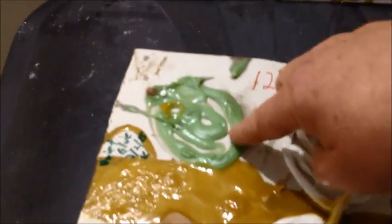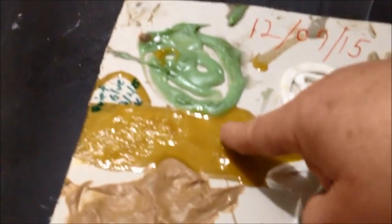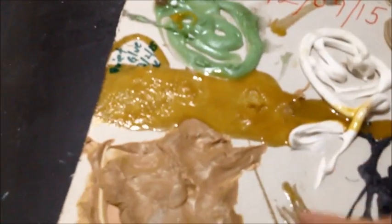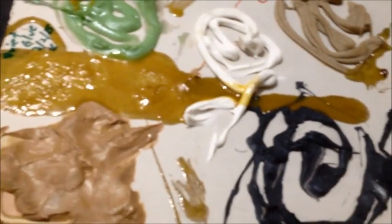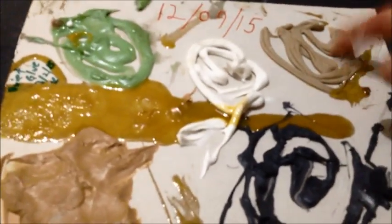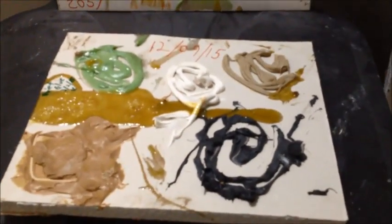One of the things that we did find out was that some work better as adhesives than others, obviously. The green glue doesn't work that great as an adhesive. You can still pry boards apart. We did a couple of tests with that. The quiet glue was somewhat the same. The carpet glue was quite a bit firmer and tougher to tear apart. And the acoustical sealant was really quite simple to tear apart. It wasn't that big of a deal. Liquid nails, of course, was liquid nails, and the caulk was the caulk. The white acoustical paintable caulk was mediocre, but not that that matters much.